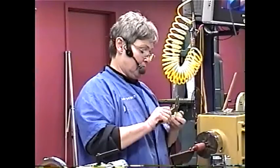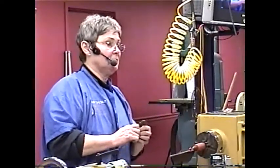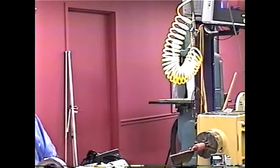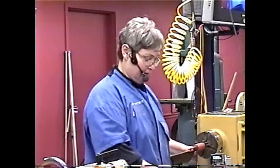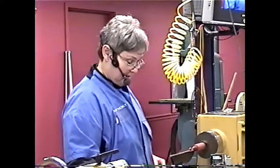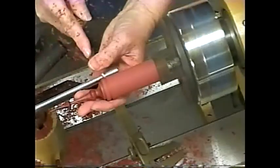This hole is real fragile, so you're better off with a tenon that's slightly too small rather than too big. Normally I make them fit pretty tight, but you can't force these at all. When I measure something, I usually leave a little fudge factor because I always cut things too small, but in this case I can't afford to do that or else it will split the shell out.